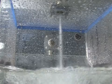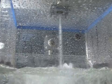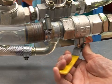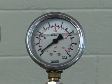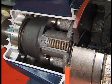However, the output from the pump will be reduced and not be as required by the process. This condition, caused for example by an inlet valve shutting off, inlet filter blockage, or continual operation of the pump at zero outlet pressure, upsets the balance of the pump and should be remedied as quickly as possible. Prolonged use under such circumstances will inevitably cause damage to the hydraulic end of the pump and its bearings.